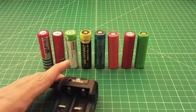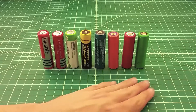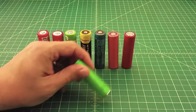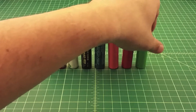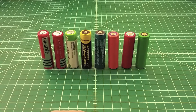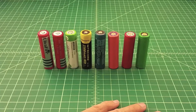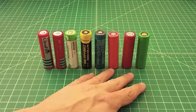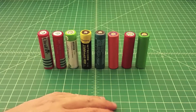This is a VP1 and it allows me to charge two batteries independently. These first three batteries right here are batteries that I've harvested out of old laptops — old laptop batteries. They have different colors and different wrappers on them. A lot of times they'll have a serial number, and you can look them up and they'll tell you how many milliamp hours they have. Typically it hovers around 2000 mAh. Most of these batteries, if not all, are made by Panasonic, and then the different companies put wrappers around them and add their own integrated circuit protection. Early on I used exclusively these laptop batteries, but I've kind of turned away from that because they don't have integrated circuit protection.